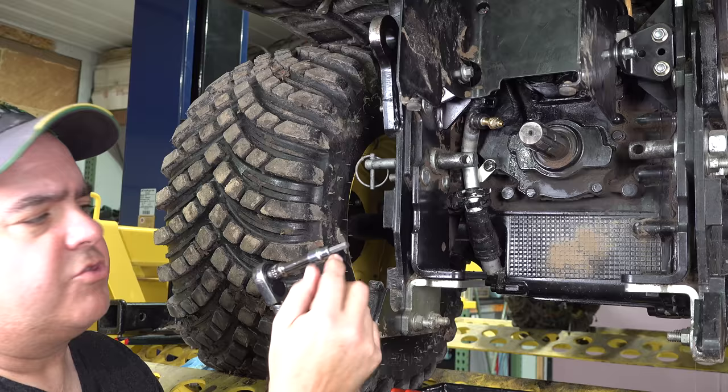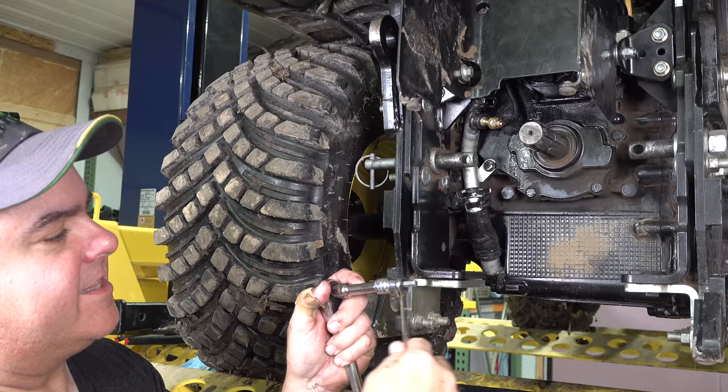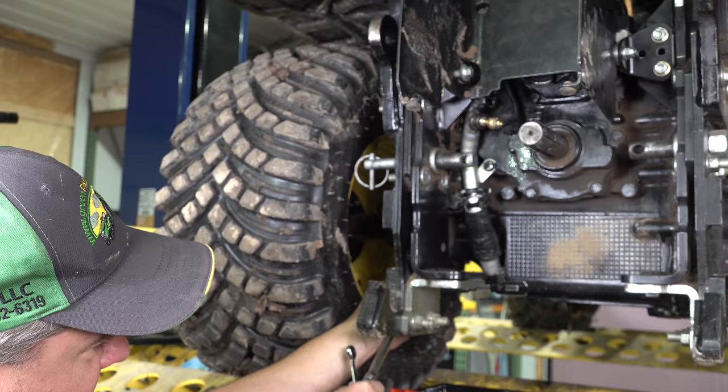Let me show you that trick. The way my Allen wrench is made, it's 6mm for just a little bit, and then this is actually a 1/4-inch hex here. So I got a 1/4-inch. In fact, I got a gear wrench, and I could slide on that like that. So if you can't get the entire socket, the ratchet and everything on, you can use just the socket and slide your quarter inch wrench on there to help you turn it. Just a nice little trick. But in this case, I believe I can get the socket in there. The entire extension, the ratchet, and everything we need.